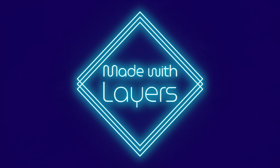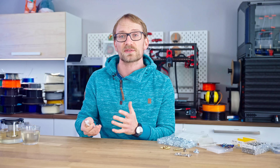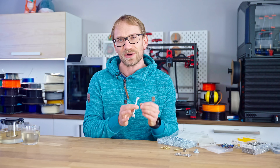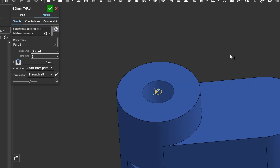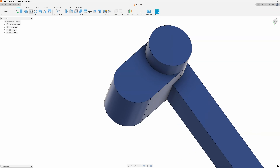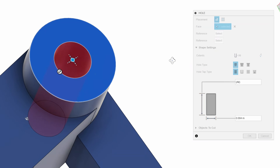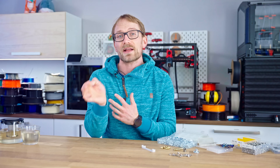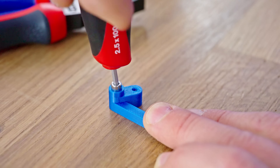We're going to start simple with the humble straight hole. This is arguably the easiest to design, but in practice it's the hardest one to get right. Any CAD suite has a hole tool that you can place anywhere and then tell it what exact hole you want. The small M3 thread is my most used type of screw, and to get that to bite into an unthreaded hole requires super tight tolerances from your printer.